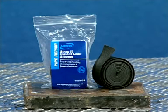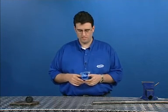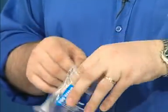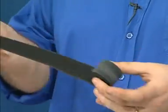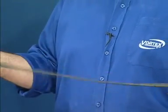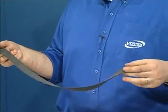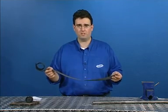This is the Vortex Strap-It, designed for doing instant leak repairs on rigid pipes — steel, plastic, and stone-clad pipes. This is designed specifically for doing temporary instant repairs. It's not an adhesive product. It's quite simply an EPDM rubber belt, which is very, very strong in tension and is also resistant to 120 degrees Celsius and is extremely chemical resistant and hydrocarbon fuel resistant.